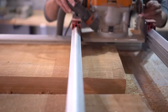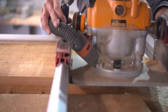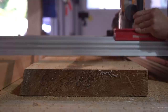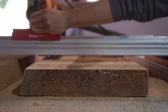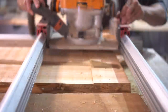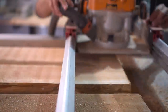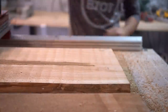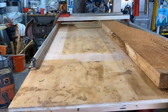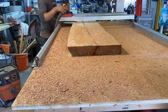These slabs are quite flat so I don't actually have to plane them down, but to make life a little bit easier on myself, I do put them through my router planing system to get a nice even surface on two sides for both slabs. If you don't have a router set up like this, you don't need it — it's just going to take a bit more time to get fully sanded down. If you're looking for slabs like this, I'll leave a link to a couple of my favorite salvage yards as well as my favorite slab yard.